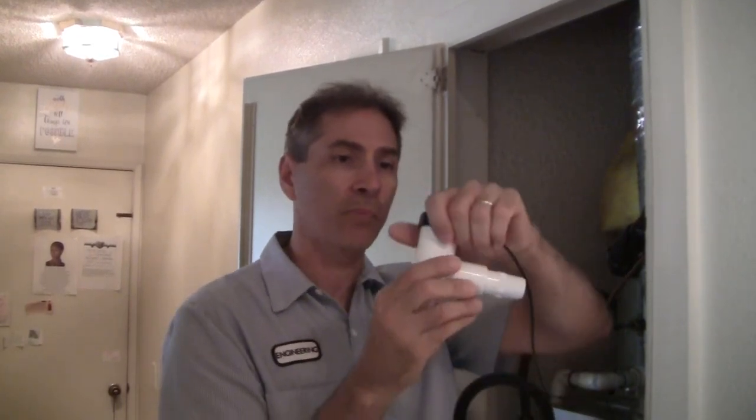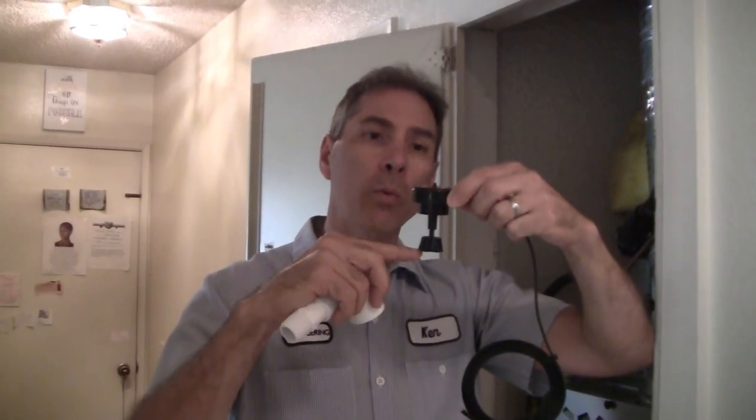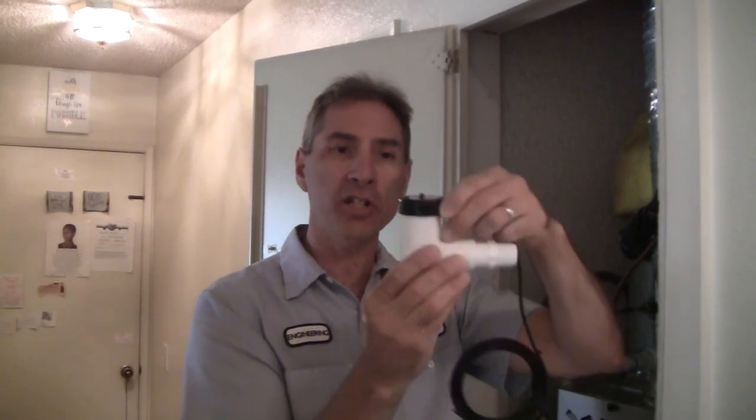This is your device — it's the EZ-Trap. It costs under $20 on Amazon. You just gently turn the top slightly and you can take it apart. This is your float mechanism. The beautiful part about this one is that when installed there's a little stem here to tell the user the float has risen, meaning there's water in here that caused the float to rise. That should never happen under normal operating conditions — this float only rises if the primary backs up.